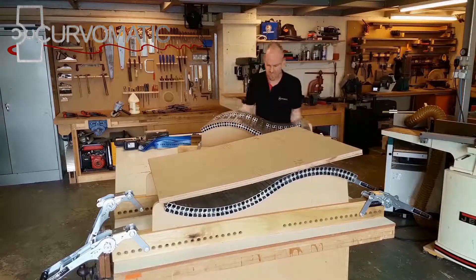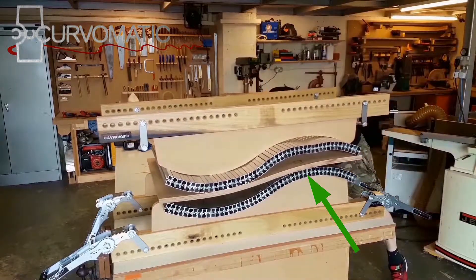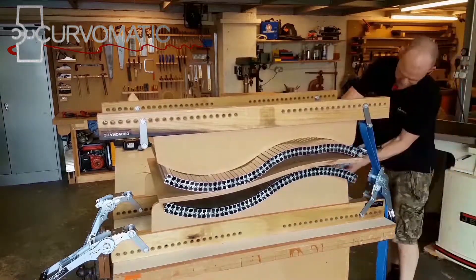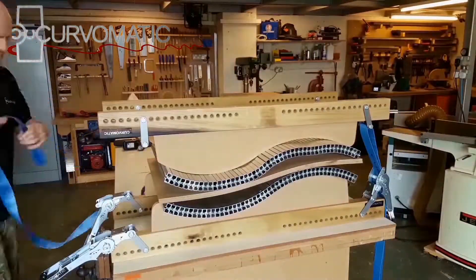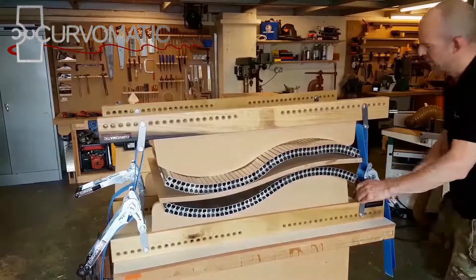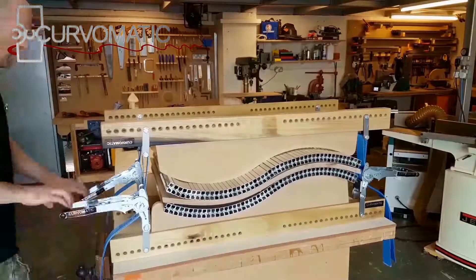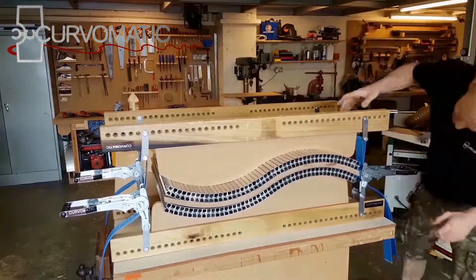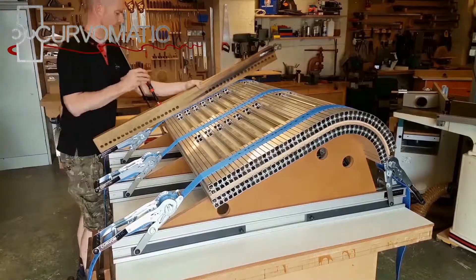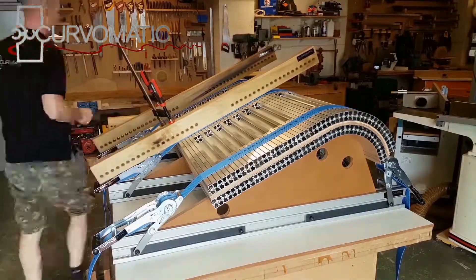For two-sided pressing, insert the nails through the laminates at the contact point with the mold and place the top part onto the laminates. Feed the straps through the rollers and put both ends through the ratchet handles. Tighten the ratchets evenly from both sides. The system will work with very little pressure if the setup is correct. When clamping flat sections with beams, you must always clamp to holes in the formers or you risk deforming the panel. This clamping method is also used for U-shapes.